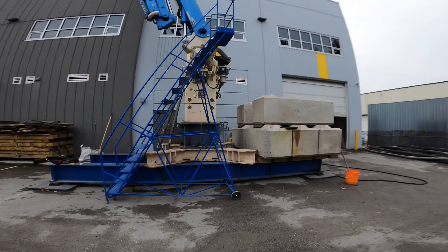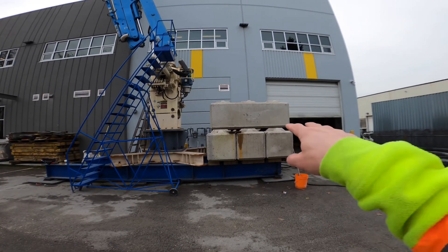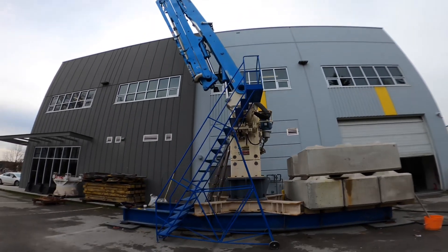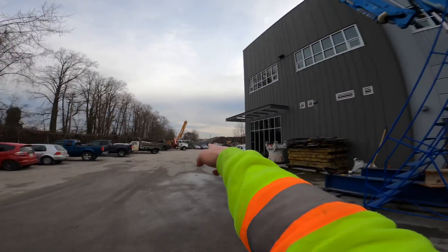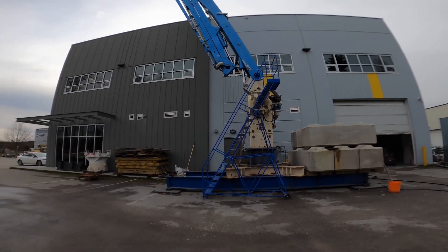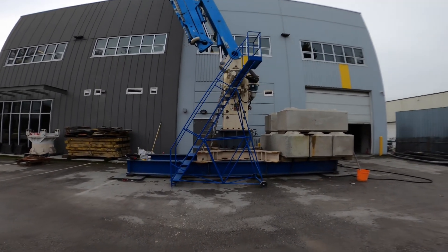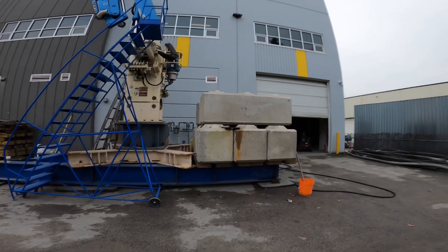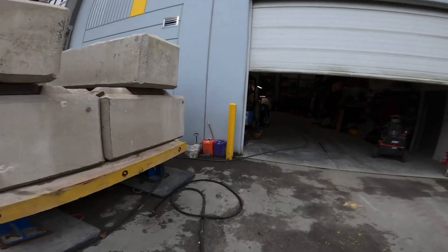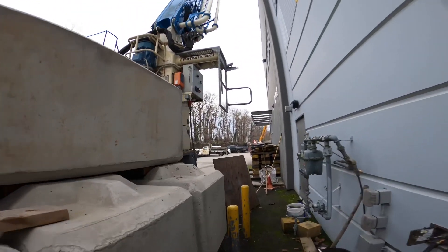So we finally got everything together here — it's a custom-built step test stand, fully engineered. I can't explain the exact logic and theory behind it, how much weight it has and where the weight is and everything else, because I'm not an engineer. But I do know we can fully stretch it out straight off the front, which allows us to do our boom inspections, tune our boom controls, swap out pipe — things like that. Super handy for maintenance, and we're lucky enough at the yard here to have the proper power supply — 480 volt three-phase, I believe.